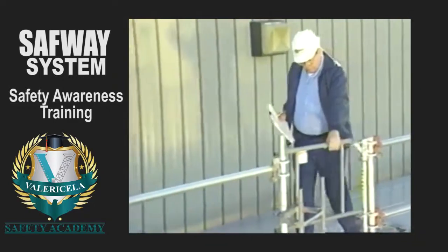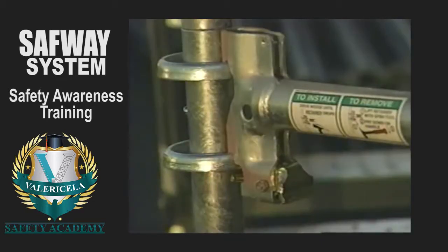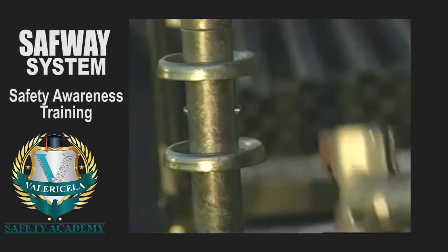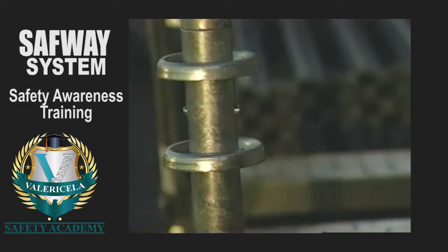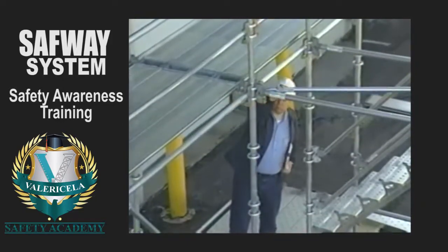Safway System scaffolding is designed for efficient dismantling. The pry bar end of the Safway hammer lifts the retainers, allowing easy removal of the wedges. Safway does not recommend the use of a carpenter's hammer to extract wedges. The carpenter's hammer may not lift the retainer and could jam the wedge, preventing removal. With this in mind, dismantling can begin.